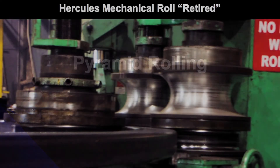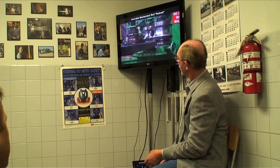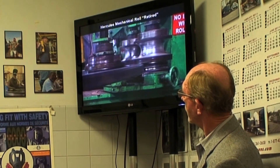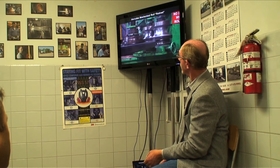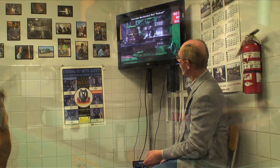We're going to start off with pyramid rolling, which is the mainstay of the most popular kind of rolling and bending that we do. This is another old mechanical machine — a Hercules mechanical roll that we used to have here, and we sold it to somebody in Alabama. The key here is that we're rolling HSS but using pipe dies as spacers, to show the versatility of trying to make do with what you have. A set of those pipe dies is worth like $100,000, so you make them go a long way.